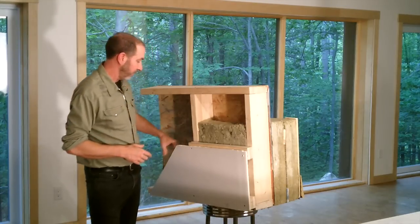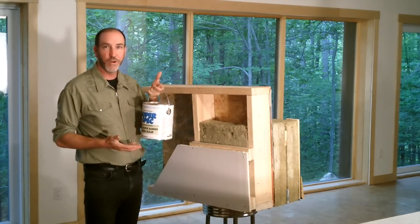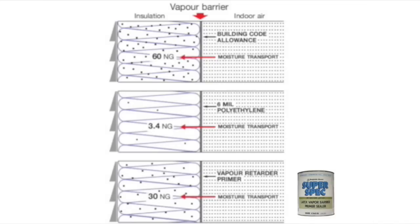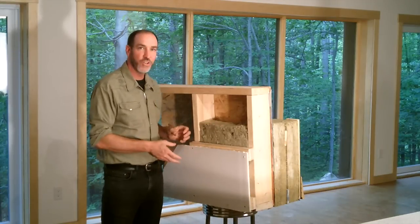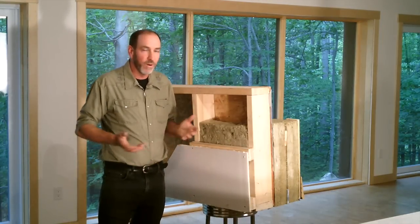There are different ways to build a wall to deal with moisture that are more forgiving than poly vapor barrier. What we're actually going with is this — Benjamin Moore latex vapor barrier paint, or more accurately a vapor retarder, because it's slowing moisture movement. That paint stops more than twice the amount of moisture required by building code, yet it's still a little bit permeable. So in the summer months, when you get that inward vapor drive, there's a chance for moisture to breathe through a little bit rather than getting stopped at the poly and creating condensation inside your wall. With the vapor retarder paint, it's breathing through to the inside where it does no harm.